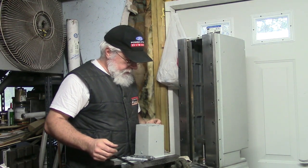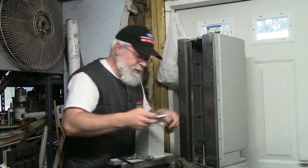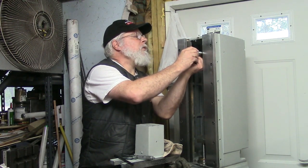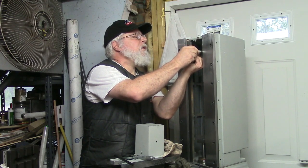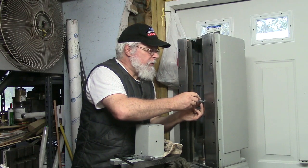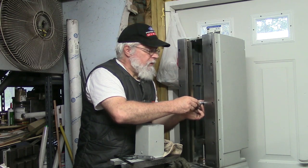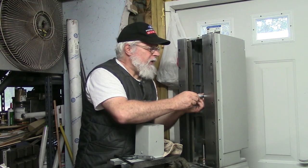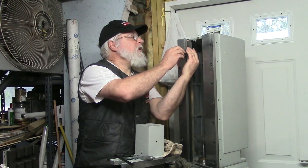All right. So now that I got that done, put this back in its box. Well, I'm going to measure it again. Let's measure it again. I've torqued it. Let's see if I've got any difference here. I believe this was about 105 up here. I lost half a thou there. This was about 102. It's now 104. I wonder if I just happened to hit a high spot. Yeah, 104. Look at this side.